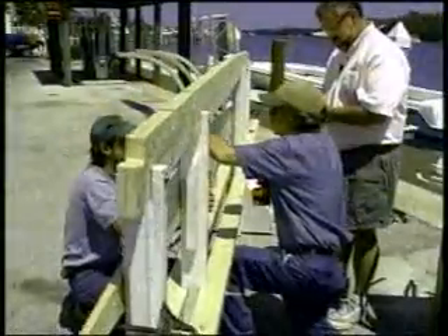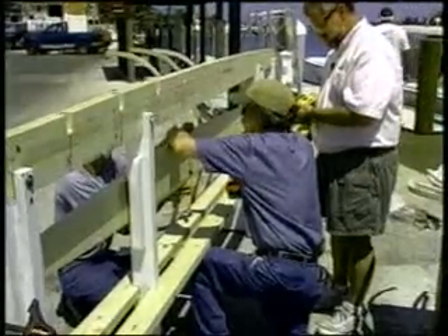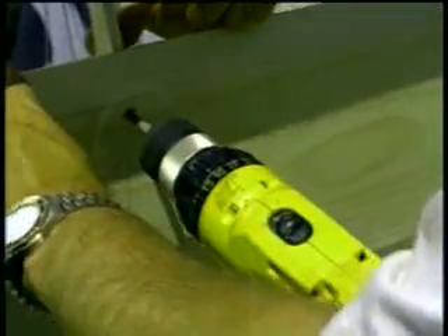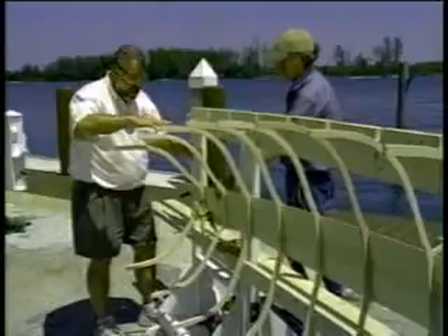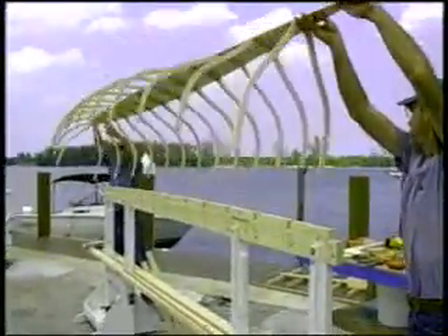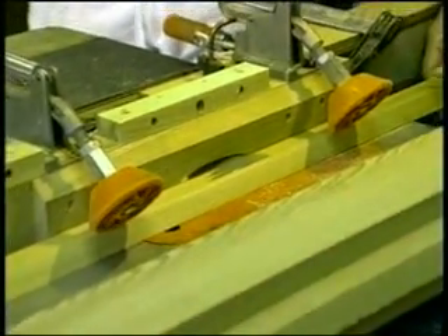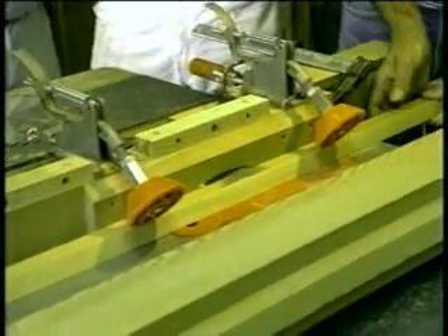We fastened the ribs using a number six by one inch silicon bronze Robertson head screw — three of them through the back and into the rib from the other side. We drilled a special type of hole, countersinking our pilot hole using a tapered fuller bit with a countersink attachment. Once we have all 13 ribs onto our bottom board, we want to set this up on top of our fixture, put in our spreaders, and begin the process of gluing and screwing on our strips. What we're doing here is cutting strips for our cedar guide boat — the table saw is mounted with three very thin blades, and we get three boards per pass. The blades are set at 22 and a half degrees.